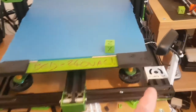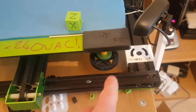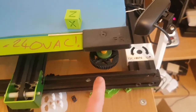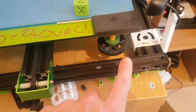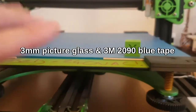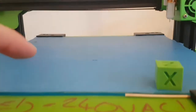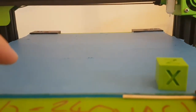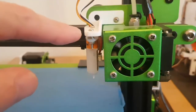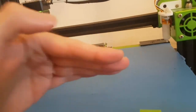Next, I printed out a label guide because I kept forgetting which way the screws go to make the bed go up and down — very useful. I've also printed adjustment wheels which make it easier to level the bed. I've got glass on it now, which takes the warp out of any curvature on the bed, with 3M 2090 blue tape. I fitted a genuine BL Touch with a mount from Thingiverse and a firmware update that does a 5x5 bilinear levelling grid.